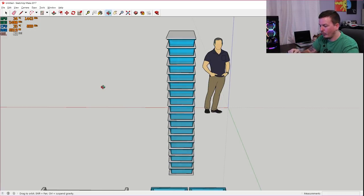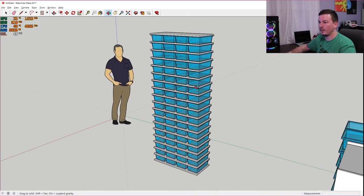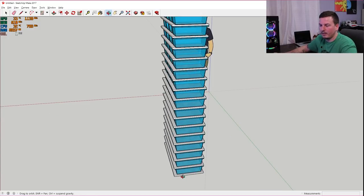Now we need to build a cut sheet so we can figure out how much melamine we need and the most efficient way to cut it. For that I use a program called Workshop Buddy — the website is workshop-buddy.com — a cut optimization generator. The cool thing is it handles sheet material like melamine or plastic, or linear stock like 2x4s. The cut list for the rat breeder rack also came from here, using the 2x4 linear option.